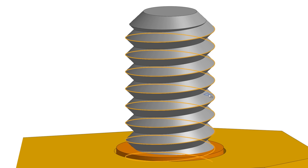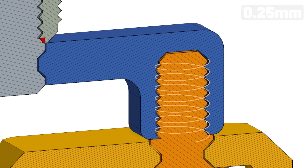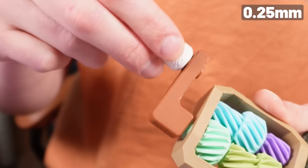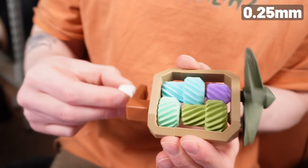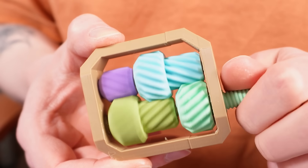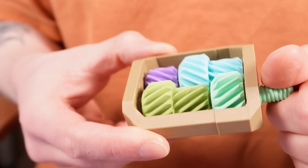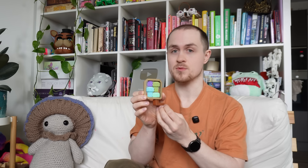I also like to round the sharp edges of the thread because otherwise you might get a thin and grainy edge, which wouldn't be ideal for printing. In terms of the gap between thread faces, I went with 0.25mm — a little more than it really needs, but I knew the threads would bottom out and be tight at the end, so the extra wiggle room doesn't hurt. Printing with overhangs also allowed me to use helical gears in my design. Since the angle on these gears is only 30 degrees they print great, and that helical shape gives a little bit of extra tooth engagement — and it also looks cooler than straight gears, which is important.